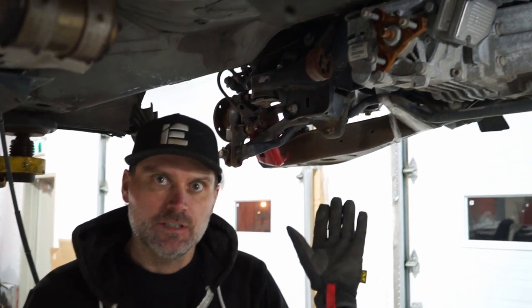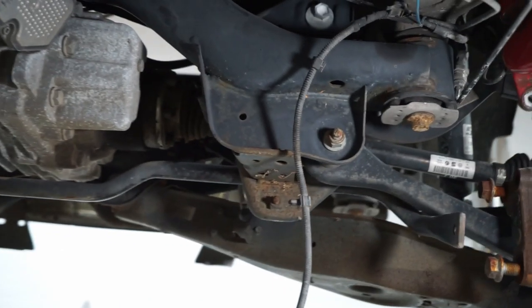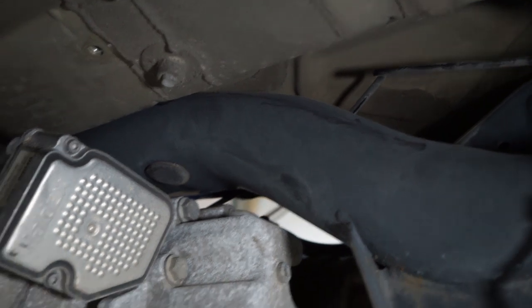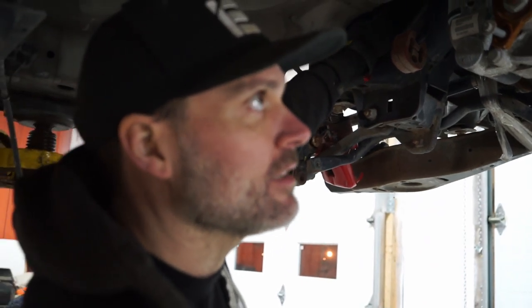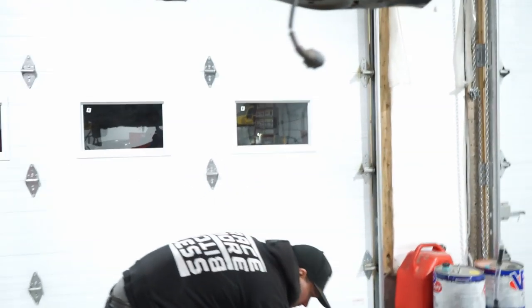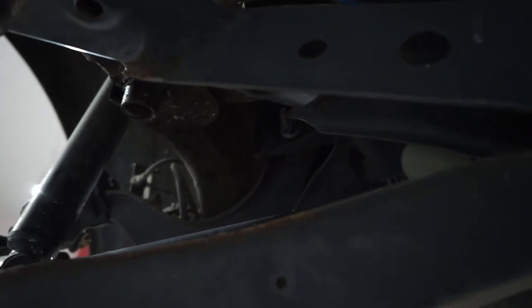There we have it. The all-wheel drive is up in place. It's bolted with the four subframe bolts. It looks like the line that I was talking about earlier that might need to be replaced, we might be able to actually use that. It might not be routed completely correct at this point, but it looks like we're good. I did have to trim the piece of the bracing that was in the spare tire well that was up in here. I had to trim that out some more, so I'll be cleaning that up later on as we start building the pan. Obviously, we'll come back through and clean up all these sharp metal edges and all that stuff.